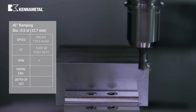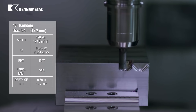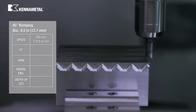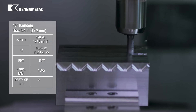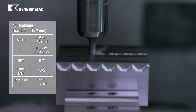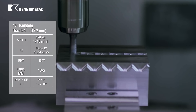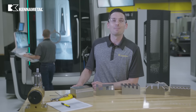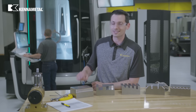We're now going to show you a continuous ramping pattern that emphasizes the 45 degree cutting capability. We'll start ramping up and down at a 45 degree angle with a radial depth of cut that is 40% of the diameter. Next, we'll continue ramping up and down at a 45 degree angle at full radial engagement. I hope you enjoyed learning the many capabilities of the Harvey 1TE. Until next time — smooth it out!